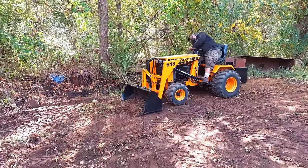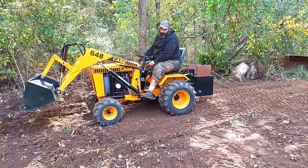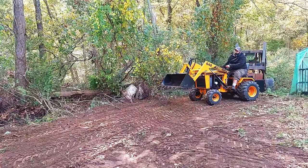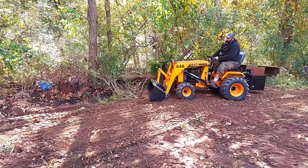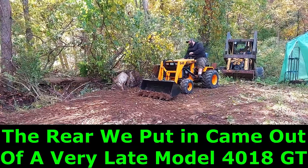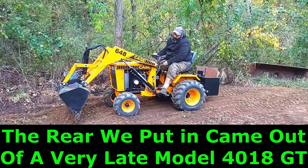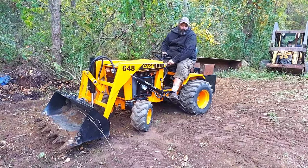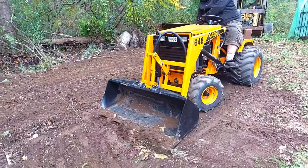With this pump the machine works out pretty darn good in high range - you've got a bigger pump there, the motor feels it but it's not horrible. It's got a lower high range gear so it's actually really useful with the loader. Most of the time high range in these machines tends to be pretty fast and almost strictly for transport, but with this machine I run in high range almost all the time. The lowered high range with this rear end works well especially with the bigger pump - it's very strong and reactive. Most of the time when running this machine it's quarter to half throttle at most, so the speed works out really well at those RPMs.